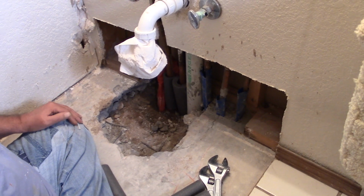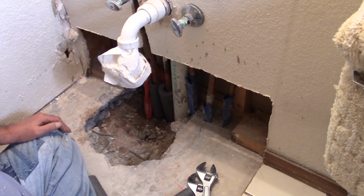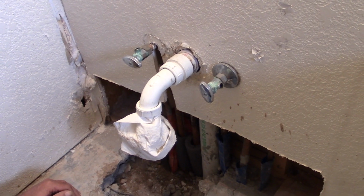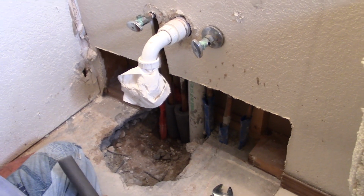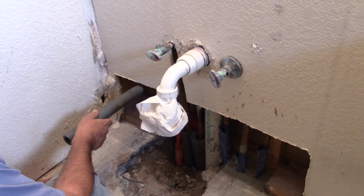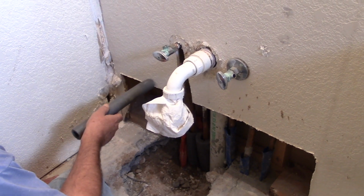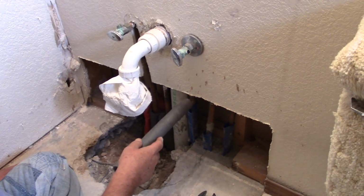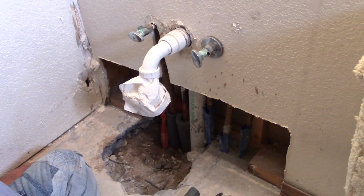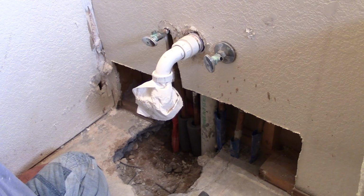I've got some construction paper or packing paper you can use for a template. Well, I'm probably going to be using my tape roll or yardstick. I guess the reason why I said template is because of the valves in here and the drain piece there. Yeah, that's a very good point, because I'm going to put a line to make sure that when I screw my drywall in, I won't be anywhere near these. I'll put some drywall screws over here, and then some here, and then some over in this corner. I have some packing paper you can use, and I could help you mark the valves and the drain pipe so that when you cut the template, you won't struggle here in the bathroom.